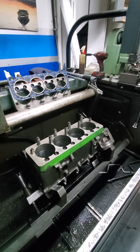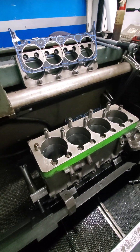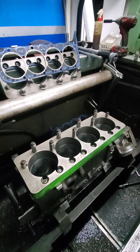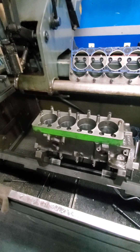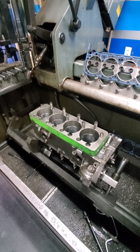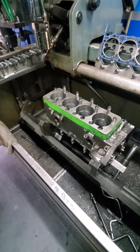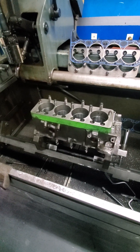So take it as you want. That one moved - I'm going to say an average of half thousandths. It pretty much went back to place when I re-torqued the plate on. That tenth or two difference in here, that is so minimal - it's just super minimal. That was pretty close. So there you have it, folks. This mid-70s 010 moved quite a bit less than that - I believe that was a 1992 302 block. So there we go.